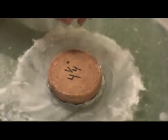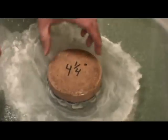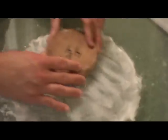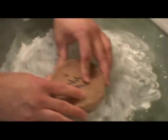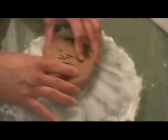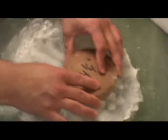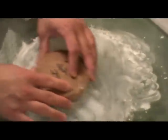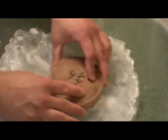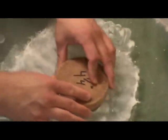That way you don't create zones. The most common stroke to reduce the center hill is just a little W stroke. The W stroke looks like this — I go from the left to the right back and forth, making W's on the surface. You don't put much pressure on a little pitch lap like this; I'm only putting maybe a pound or pound and a half of pressure. Obviously you adjust the size of the W to affect whatever part of the mirror you want — for example a narrow W goes back and forth about two inches, but if I wanted to affect a larger area I just make a larger W.